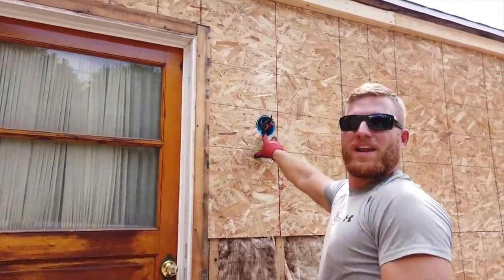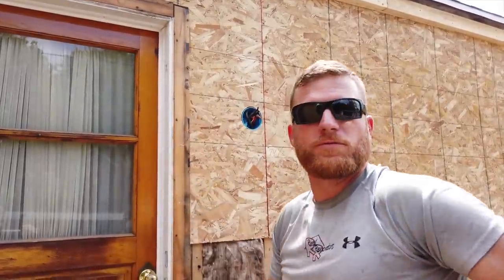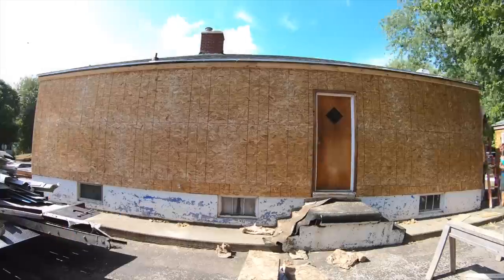Good way to get a nice perfect circle using a square — not actually shaped like a triangle. This project seemed to take forever with all the demo, but we finally have all the sheeting done. Just a little bit of fascia to work on with some drip edge where we took off that little porch roof. We're finally starting to put the house wrap back on — there's a little chance of rain tonight, so hopefully we can get it all weatherproofed until the siding goes on. I'm tired — demo is tough mentally and physically. Remodeling takes a lot out of you, so a lot of respect to all the remodelers out there. I remember what it used to be like. Maybe I also remember why I changed to post frame, because it is a lot more fun.